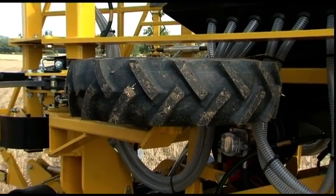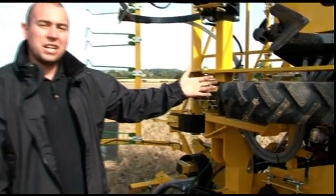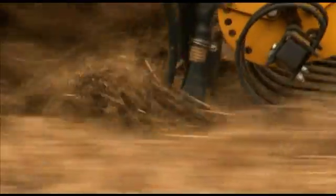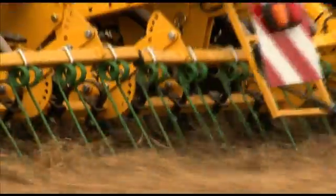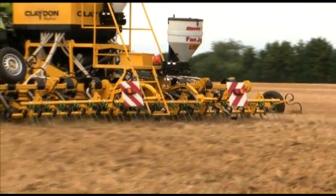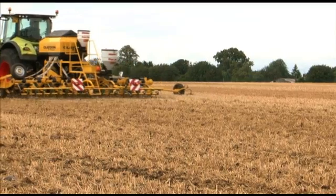Due to the mounted design of our machine, we use centrally mounted depth wheels which run on the straw and stubble which hasn't actually been turned. This is absolutely perfect because the worst thing you can do is run over freshly turned soil and press it down — there's always more moisture in unturned soil. In normal dry conditions we'd use the batter board, however in very wet and treacherous conditions we typically use these harrows. There's less chance of mud sticking and plugging on them, so it's absolutely perfect.